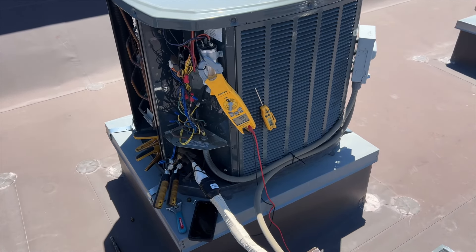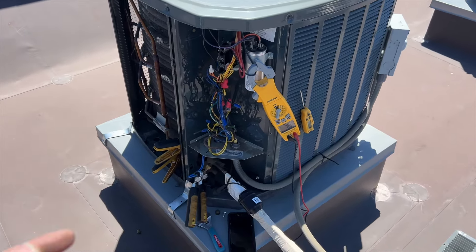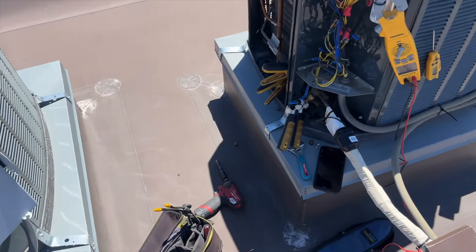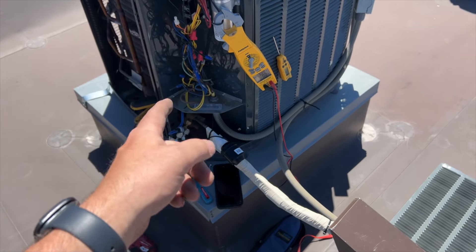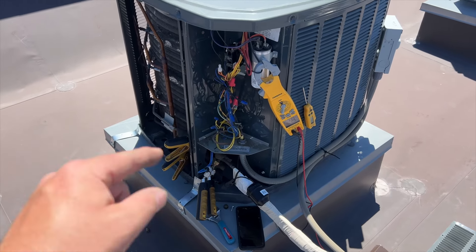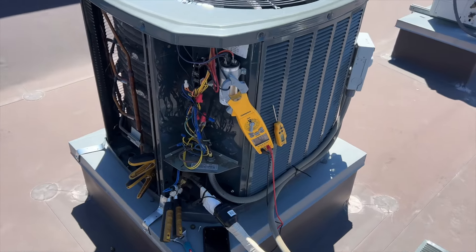These peanut-style controllers are very cheap and you can usually wire them directly into the fan motor through high voltage, or connect them to a relay. I've been thinking about this — you've got this tiny little wire exposed to the sun, so if the insulation falls apart you've got high voltage exposed outside. It's probably a good idea to run low voltage through the peanut and hook it up to a relay instead. I think I'm going to start sticking with relays and keeping the outside stuff low voltage.